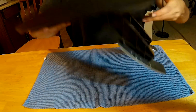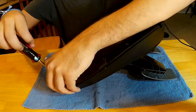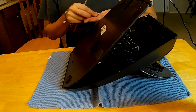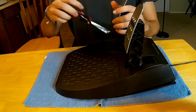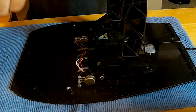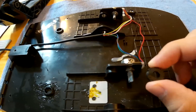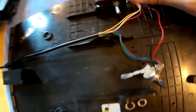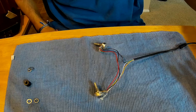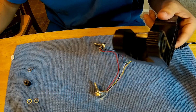Now that the brake pedal assembly was ready, I took apart the T300 pedals to expose the electronics I was going to use. I had to be extremely careful taking out the potentiometer — the plastic piece with the gear teeth was really hard to pull out from the knob. Be careful when handling and moving the cables around because you might damage the connections. The pivot points of the T300 pedals have teeth that connect to the gear in the potentiometer, which tracks the movement and distance of the pedal, and the idea was to transfer that to the new pedals.